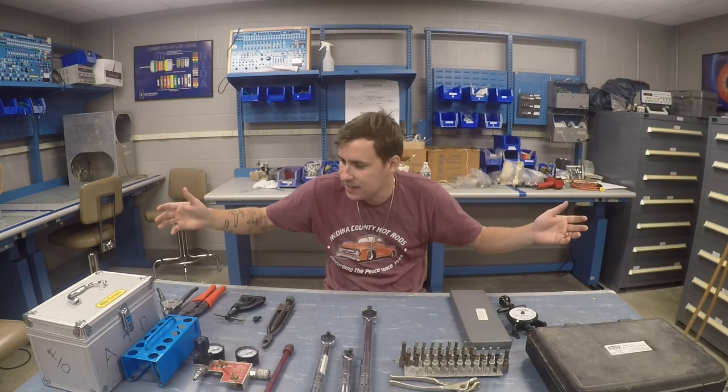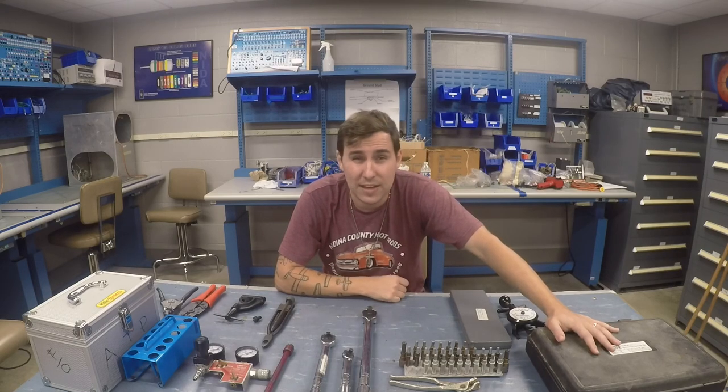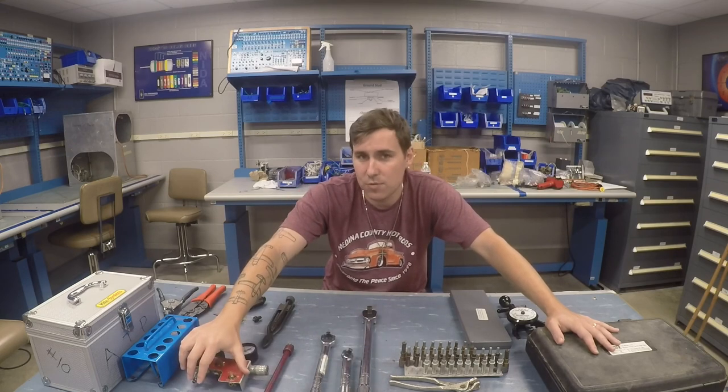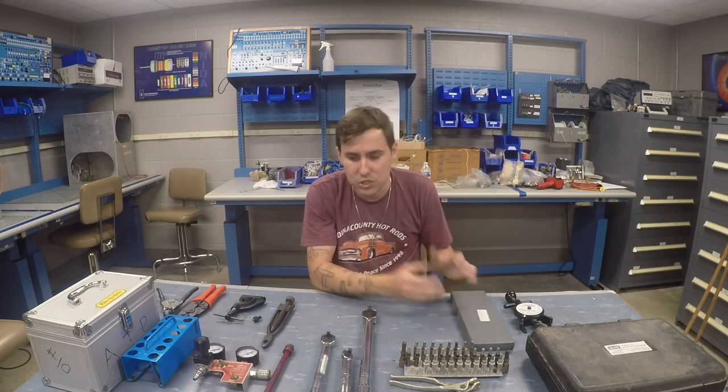All in all, I would say all of my tools have probably cost me about $3,000. Each of the torque wrenches needs to get calibrated every year, the differential compression tester needs calibration every year, the micrometer or vernier caliper needs calibration every year, and so on. Some of my tools I actually share with that other IA buddy of mine and we split the cost on calibration. Torque wrench calibration is $100 each, so we split that, and when I need them I go pick them up from the airport and bring them back.